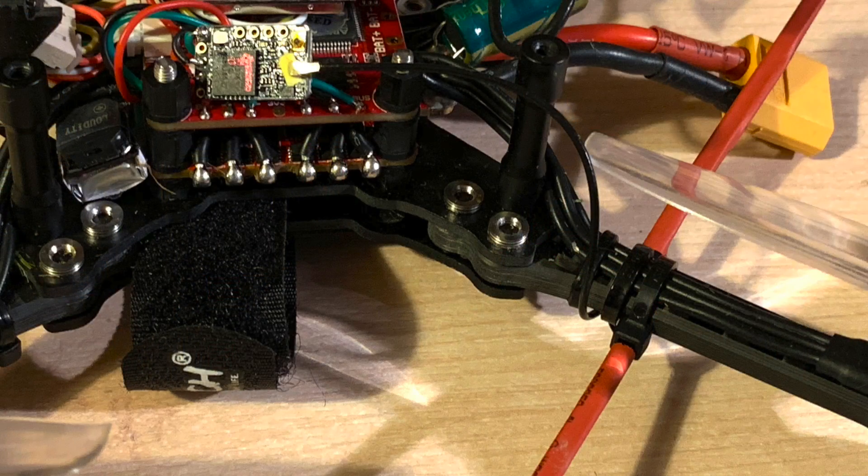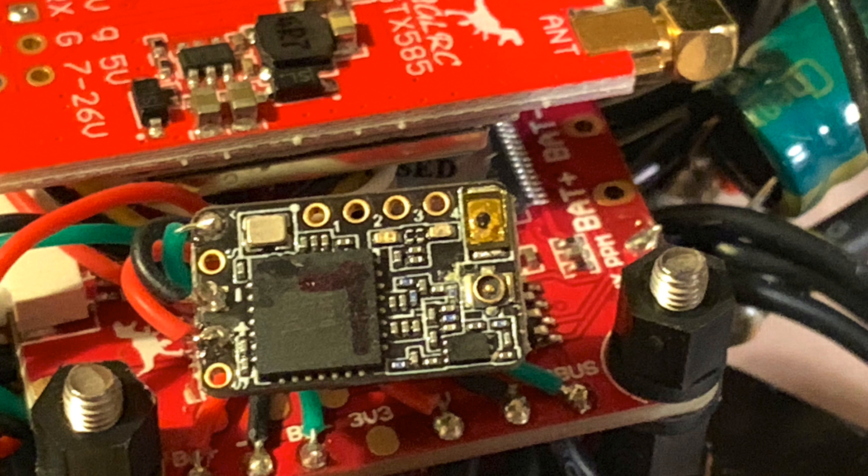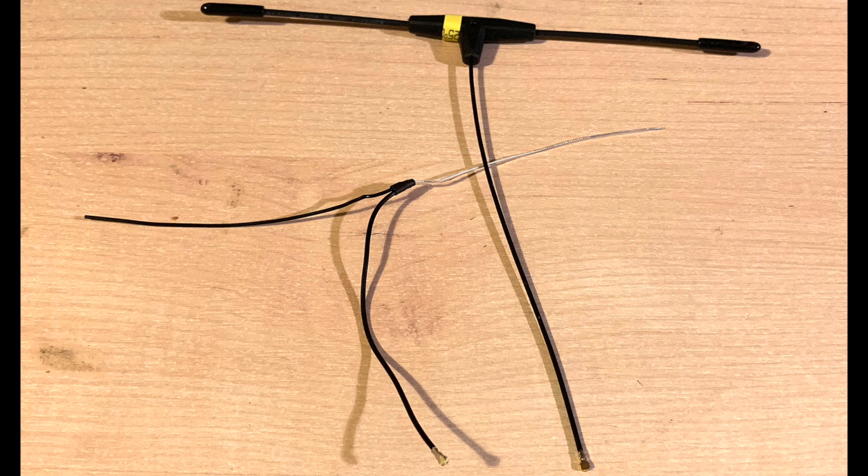Just before the flight footage, a few before-and-after pictures. This is my quad before — you can see the standard receiver antenna and my zip ties in heat shrink to keep the antennas at horizontal orientation. It seemed to do okay, so I wasn't sure whether to expect any vast differences. One thing I'd say: when removing the antenna from the IPEX 4 connector, be really really gentle. I've broken full-size IPEX connectors by not taking my time. These things aren't designed to be unplugged and plugged more than a couple of times in their lifetime. After removing the normal antenna, you'll notice there's quite a difference in cable length, giving you more flexibility in where to orientate things on the quad.